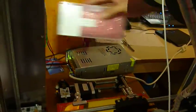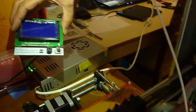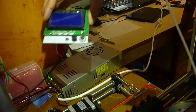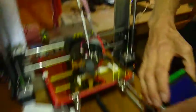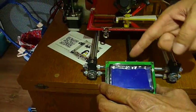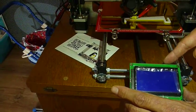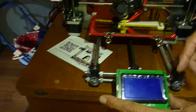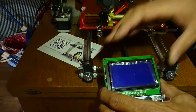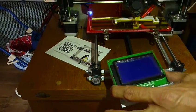That gives a second advantage: where do we put the display? The display we put in the front, which was previously kind of impossible because you can only attach around 30 cm of wire to connect it to the RAMPS. And now it looks nice — straight in front, right where it should be.